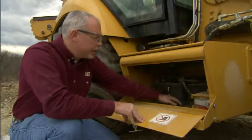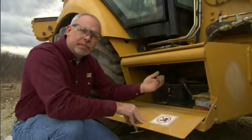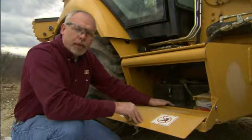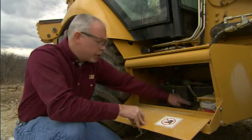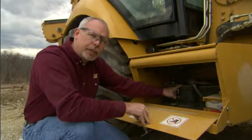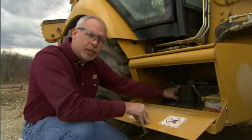Another thing that a lot of people don't think about is the dust and dirt and mud that accumulates inside these boxes. This can cause problems in time. You can get wear on your battery cases. You can actually have dust and dirt accumulate on top of the battery and get your battery to short out when it gets wet across the top.